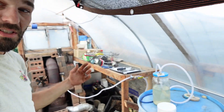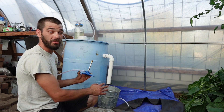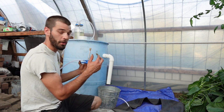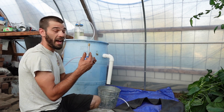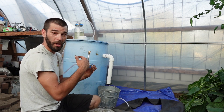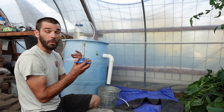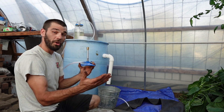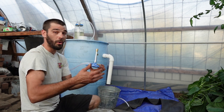99% of the time this is going to be closed off. This entire system is going to inflate this inner tube - it does not have the valve stem in it, which we showed in the first part of the video, so it's going to freely inflate and deflate as we allow pressure to flow out to our burner or as pressure flows from our tank through the bubbler into the storage tank.